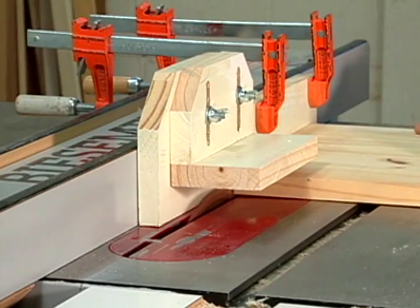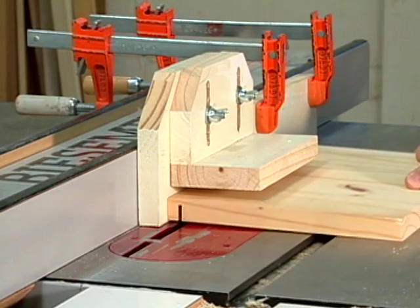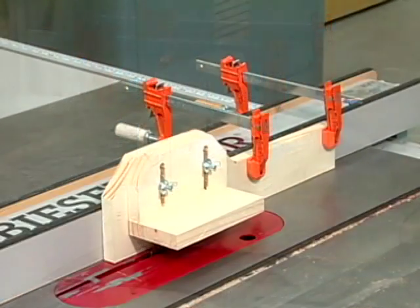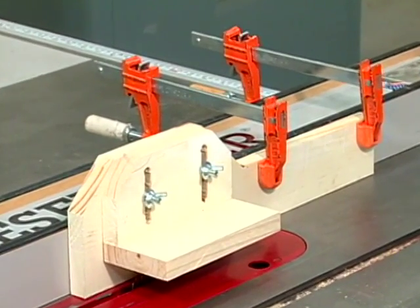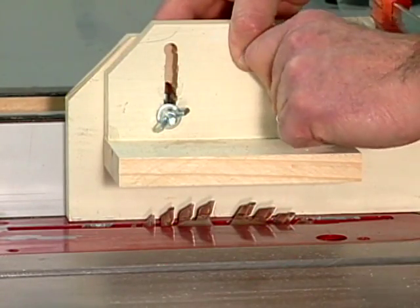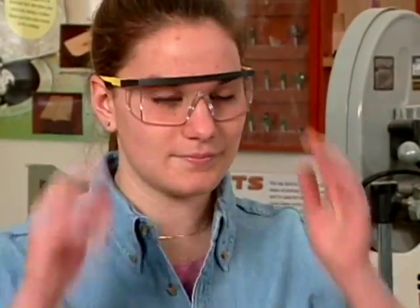To avoid an obvious safety hazard, a simple wooden guard made from three-quarter-inch material can be used. The two-piece guard consists of a backer board that attaches to the fence and an adjustable guard that shields the blade. Finally, always put on a pair of clean safety glasses along with hearing protection before operating the table saw.